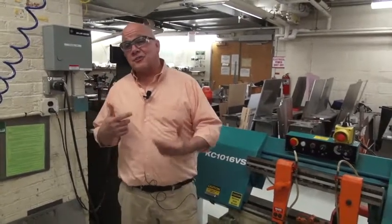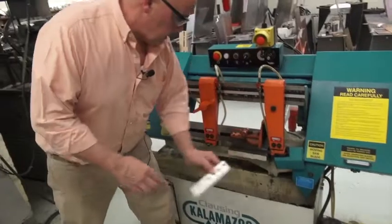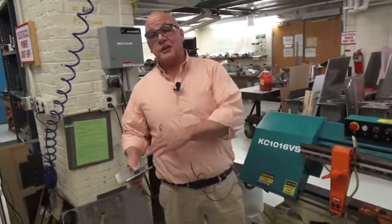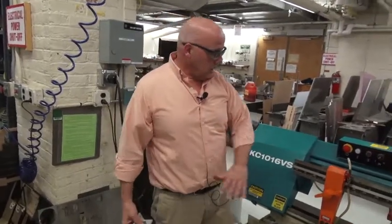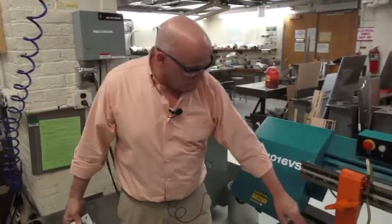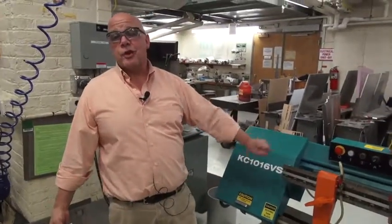I want to talk a little bit about when you're finished with the saw at the end of your session. We want to clean all the material that's been dropped out of here, and you want to recycle it if possible in a recycle bin. You want to wipe the saw down with a paper towel, and if water is on it or this coolant fluid, you want to take some WD-40 and spray it on the table so it doesn't rust. Then you're all set to go and the saw's ready for the next person.